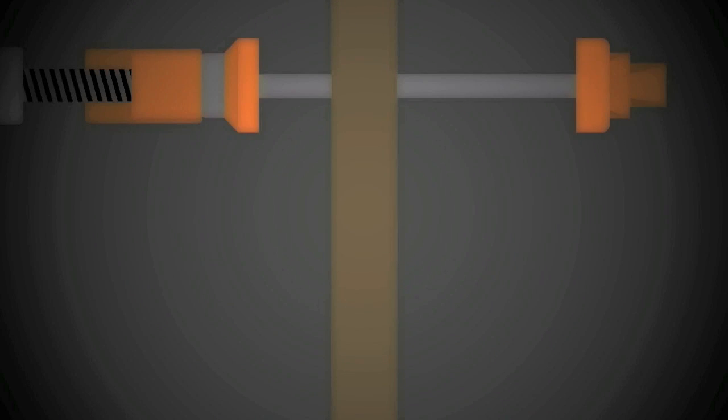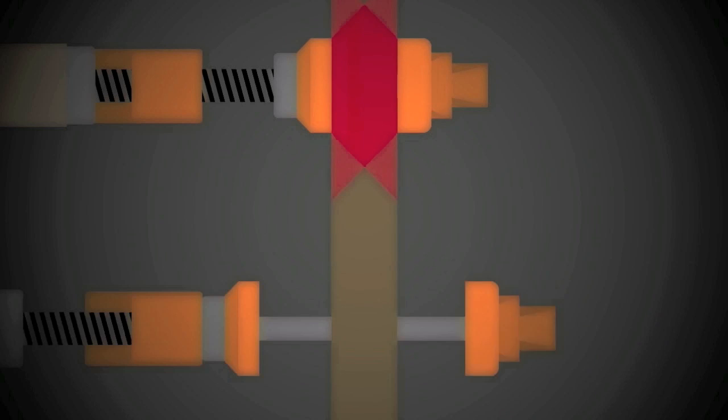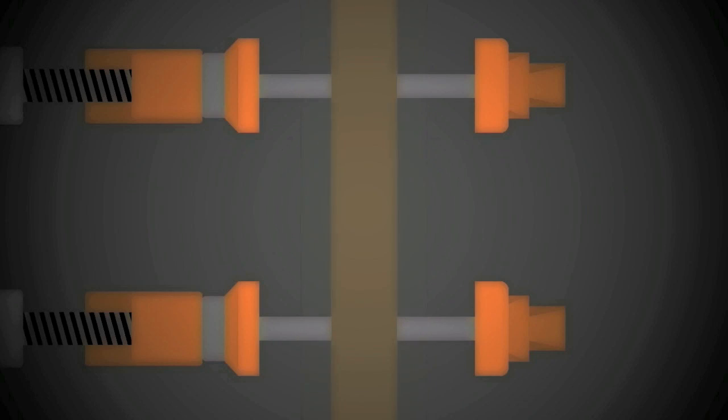Let's talk about how I'm going to glue this up. Here you see a cross section of a piece of veneered wood. Take a clamp and apply some pressure directly to the piece — the pressure radiates out from the clamps at 45-degree angles. The problem is that if you don't put the clamps close enough together, you can get spots where there isn't enough pressure. With a clamping job like this one there's only room for a couple of clamps. So here's what you do: take your piece of wood, put another piece of wood up against it — this is called a platen. Behind your platen, a bracing piece of wood called the caul. That way when you put on the clamp and apply the pressure, it radiates out over a much larger area. Now you can put on a second clamp and know that you're getting pressure over the whole surface of the wood. So when the glue dries and you take off the cauls, the platens, and the clamps, your piece of veneered wood is nice and flat.